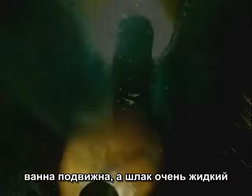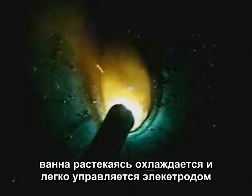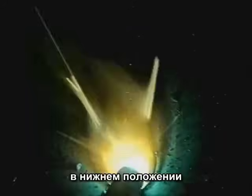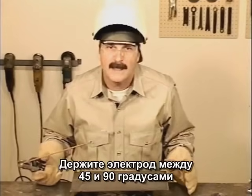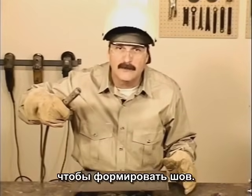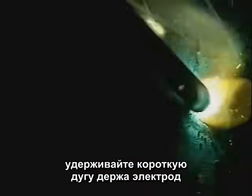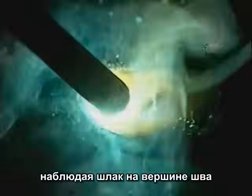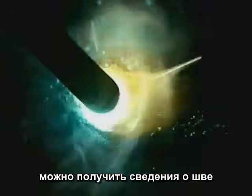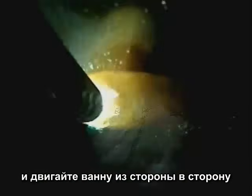If the amperage is set too high, the molten puddle and slag are extremely agitated and remain molten longer. When the amperage is about right, the weld puddle spreads out, tying in and moving easily with the motion of the rod. In the flat position, you can run straight or try a little side-to-side motion. Angle the rod somewhere between 45 and 90 degrees to build up weld bead. Scratch start, start the puddle, and maintain a short arc gap — even to the point of lightly resting the tip of the rod on the metal. Watch the puddle; the slag covers the top edge but you can still get an idea of the weld buildup. Watch the sides to keep the weld bead straight and just ease the puddle side-to-side.